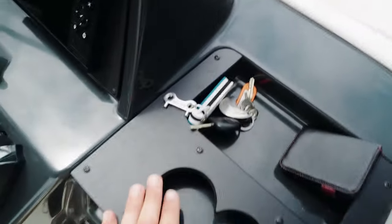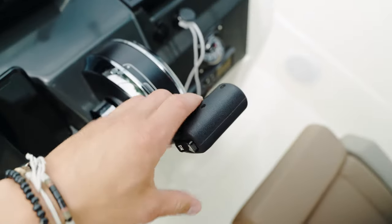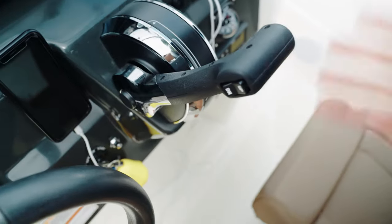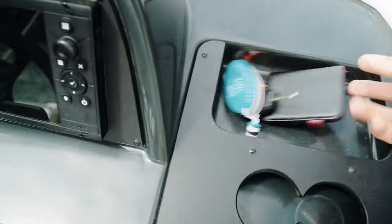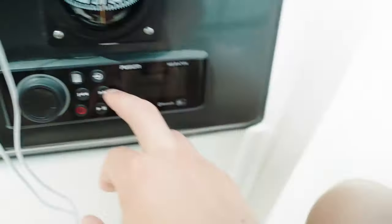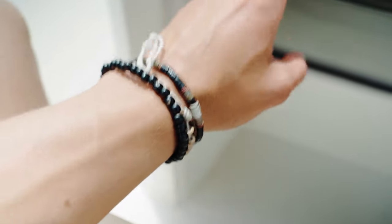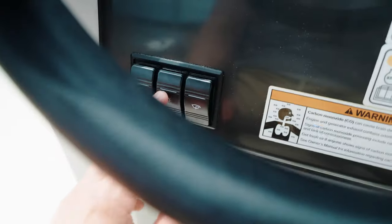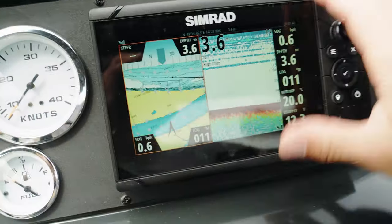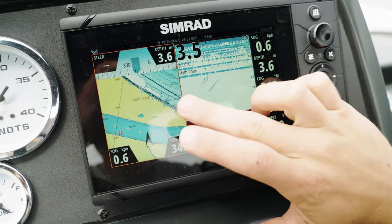This is the helm of the boat. I love it — the center console is just a great way to drive a boat. You've got the steering wheel with hydraulic steering, and the throttle unit, which doesn't have a safety release, operating by cable — no fly-by-wire. There's a little storage where my key goes, drink holders, a standby compass, and a Fusion radio with two speakers. I've got the key and kill cord right here, plus three switches: bilge pump on automatic override, position lights, and an anchor light. I fitted this myself with my dad, the co-owner of the boat. It's a pretty good system — water temperature, sonar, and a GPS map.